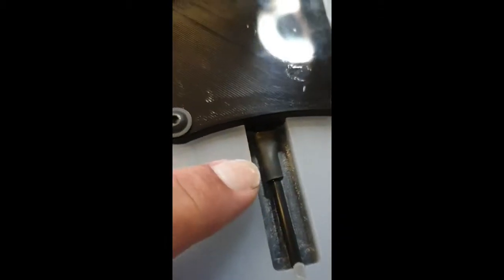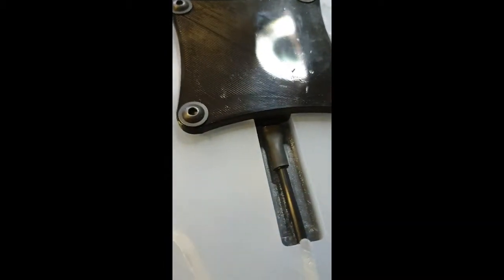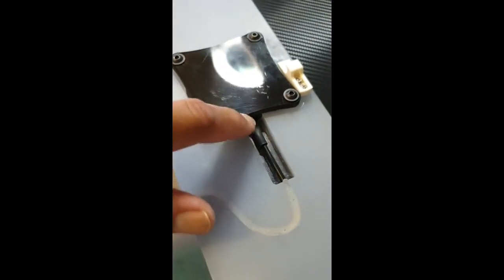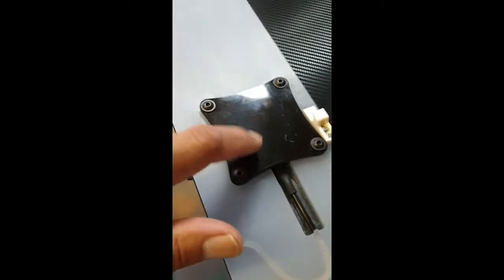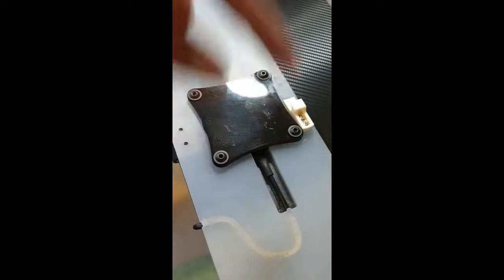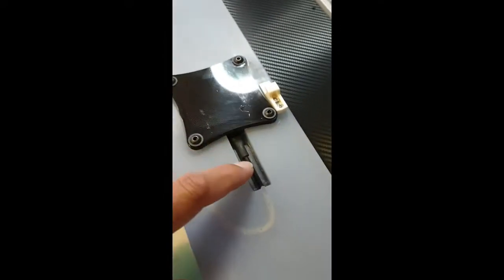A bit difficult to see, but I just got bare micro USB connectors, soldered the two wires on, and a little bit of heat shrink with the glue-lined style as well. So when I shrunk it on, it's got the glue, which has got in between the wires and everything else and created a nice solid joint. So then that just comes here. That is disconnectable as well. So if there's any problems with that wireless charger, we can just take it out, disconnect the lead, replace it, put another one back in, and away you go.